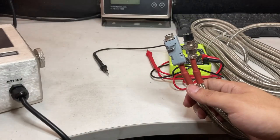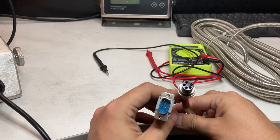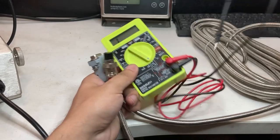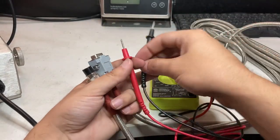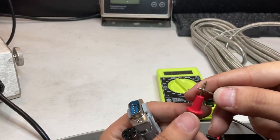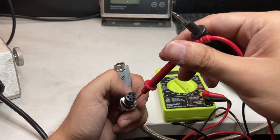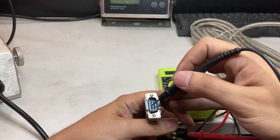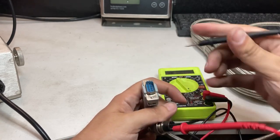I'm going to show you how to connect the 900BSL to our scoreboard. First, we're going to get a multimeter. You don't have to do this, but I'm just showing you the process so you know which pins are which. Set it to continuity and you will hear a beep. I did this previously so I'm going through it quickly.